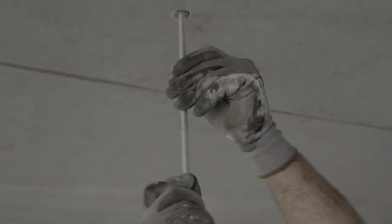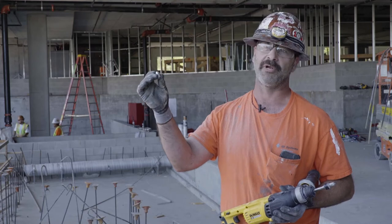You don't have to put a rod coupler on it, there's nothing else you have to do except run your all thread up in there and put a jam nut on it, and you're finished. It's five times easier than setting a regular anchor.